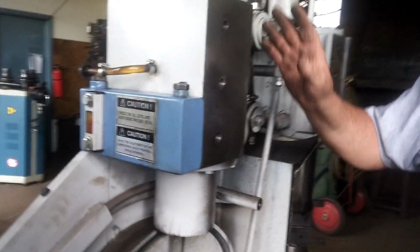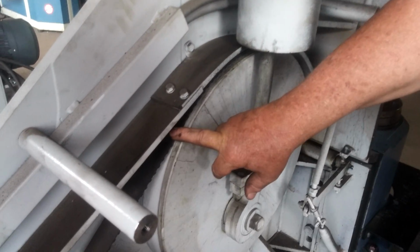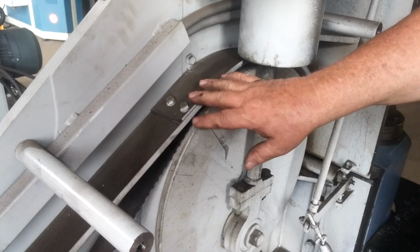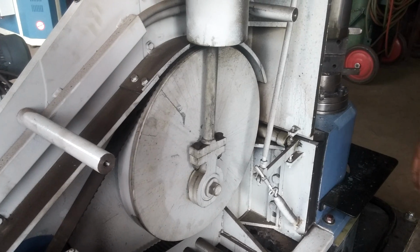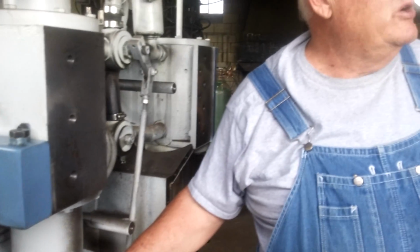And the fender. We do get some oil dripping out of this cylinder, and it would get on this belt. Some other brands of hammers have trouble with oil on the belt. So we designed this oil shield, which simply works like a roof and runs the oil off each end where it's of no consequence. It really doesn't make any difference which way this hammer turns. That piston doesn't care whether this is turning clockwise or counterclockwise.